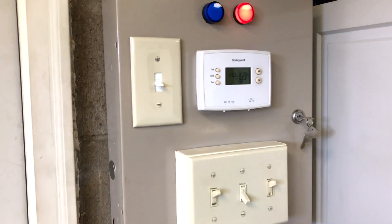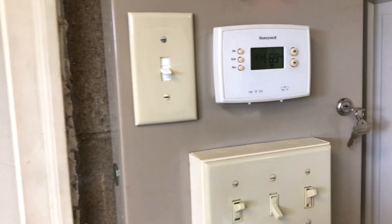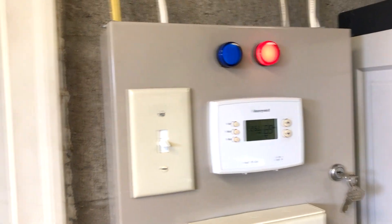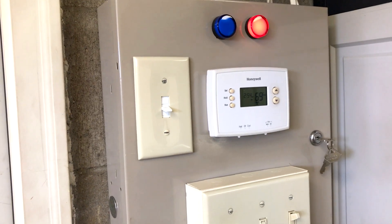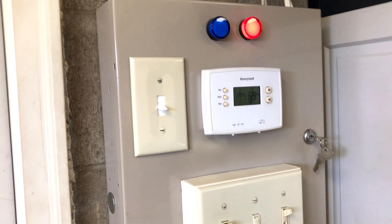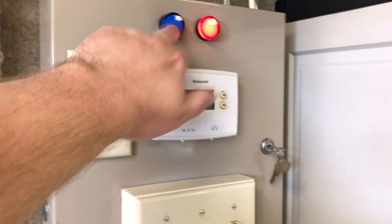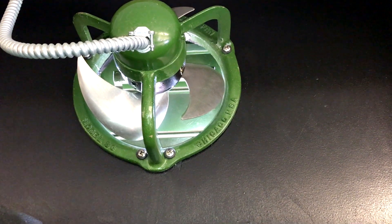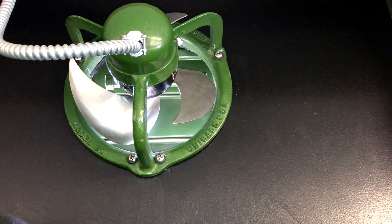As you saw from the box, it's a fan and light switch. The light is not on a timer, so if you have the switch on the blue pilot light is on. When you turn the switch off, it doesn't immediately turn off the fan — you'll hear a quick blip in the power as it switches over to a timed relay. You'll hear a click. It'll run for 15 minutes then shut off, but while it's in the timed off position the pilot light goes out to indicate off.